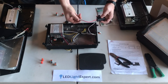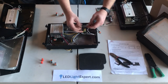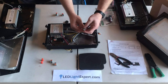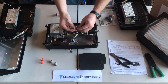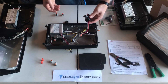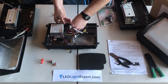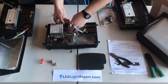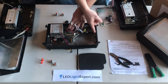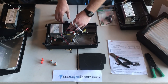Clip that in. The red is going to be your out to the power on the driver. Make sure you don't get those mixed up. The photocell often has instructions on the back just so you can't get this messed up — it's really important to make sure you have these correct. Once you've got the photocell wired, make sure everything is sealed real good. Use some sort of sealant or Teflon tape around these, along with any gaskets that come with it.